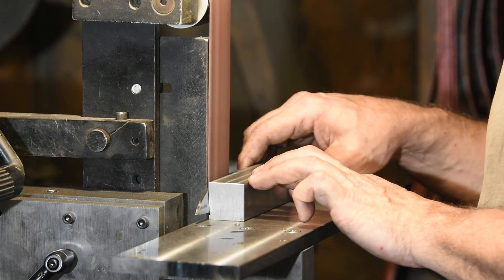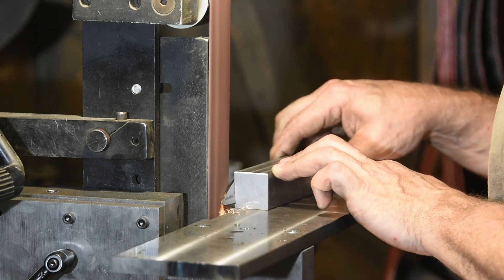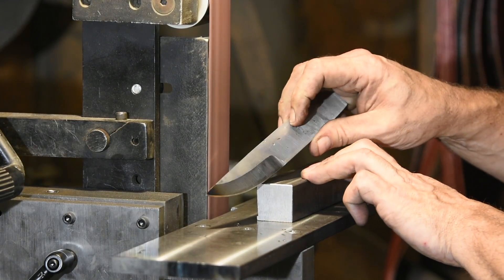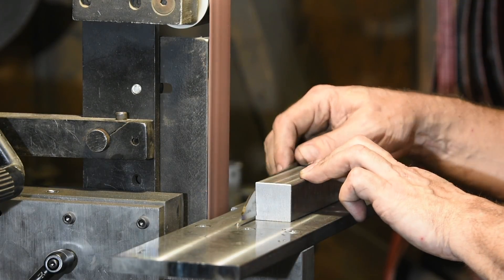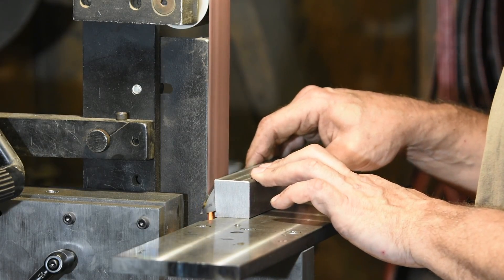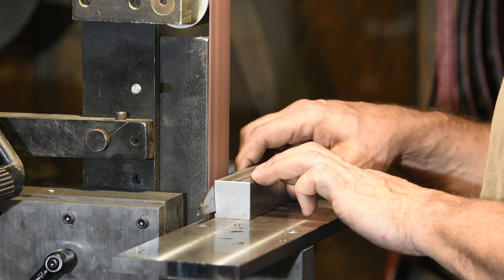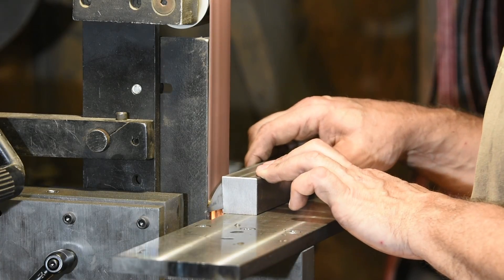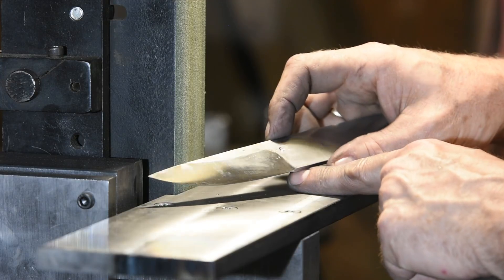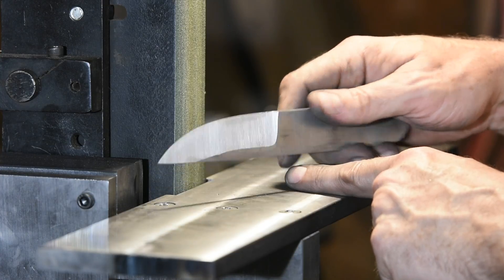Just a word about jigs: they don't make you into a perfect knife grinder. There are still plenty of ways to screw up, but they definitely make things quicker and easier than freehand grinding. Another good point about this particular design is that the mass of the stock — the jig that it's turned into — makes it a good heat sink. That means you can spend less time cooling the blade in your water bucket, because the jig sucks all that grinding heat out of your blade. After I'm done with this one, I'll probably make a couple more — five degrees, maybe five and a half, maybe six. That actually covers almost all the blades that I make. Then you can just sit them next to the grinder and you'll never have to tinker with a grinding jig to find that perfect angle again.